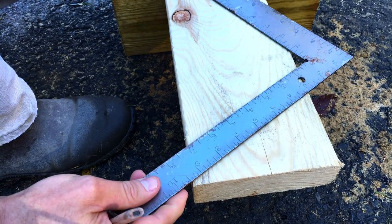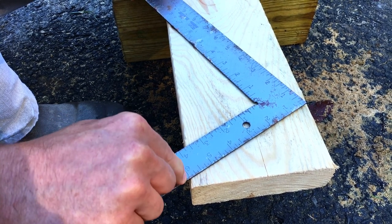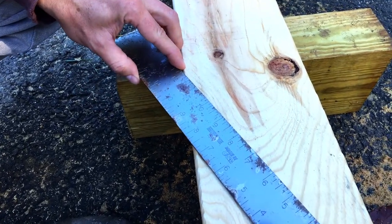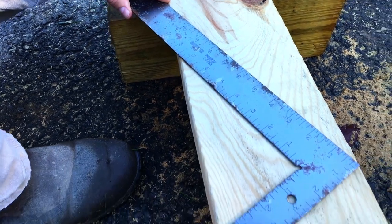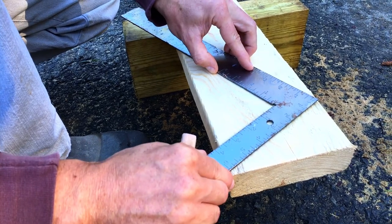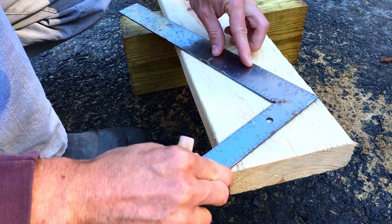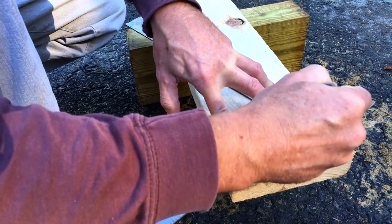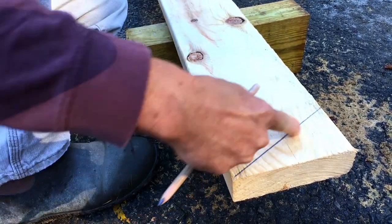We have six inches of rise on the edge of the board, and then we go over on the top side of the run and go twelve. You're just touching the edge of your two-by-six with your six and twelve, right there. Then I just pull it over towards the corner because I'm just going to cut this off for the plumb cut — I just want to go to the edge of the board so I'm not cutting off more than I have to. Then you just strike a line. That's going to be a plumb cut — this will go up against the ridge board.